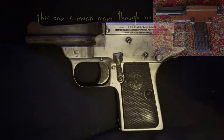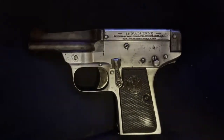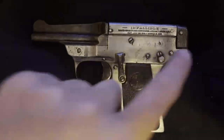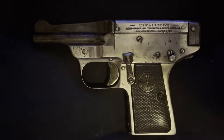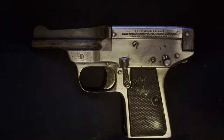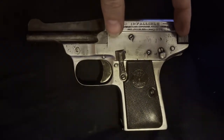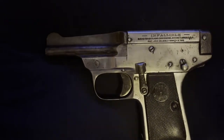The trigger spring is good. The magazine spring is still a little weak, but I think it's mainly due to the way you grip it that it wants to pop out all the time. The striker spring was broken in two places, so to make this a shooter again I'm going to have to find a spring — which is unobtainium — I'll just have to find a good facsimile of about the right length to replace it.